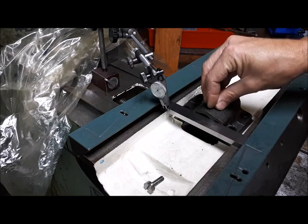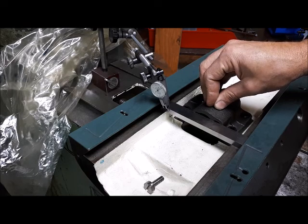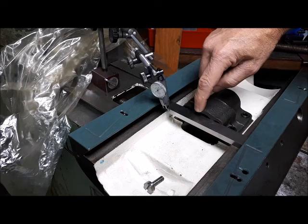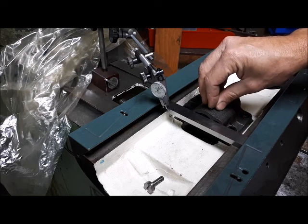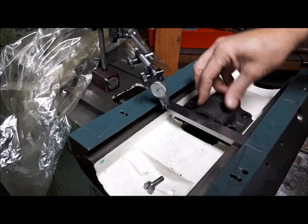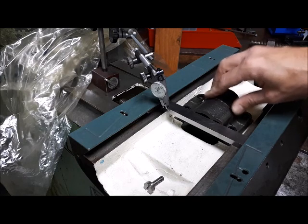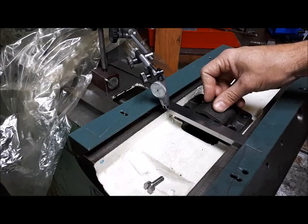The other thing I wanted to do was figure out how to set up the yoke. I had put the screw in and was trying to figure out how to measure side to side, and then it hit me that this face on the yoke and the 90-degree face on the bottom are machined. I'm pretty sure as they machine these yokes, that would be the face they'd run the bores perpendicular to, and the brass nuts, being cylindrical, would end up in line with everything perpendicular to this face. I thought that was a pretty good way to set this up.